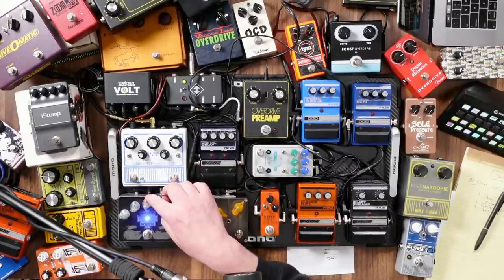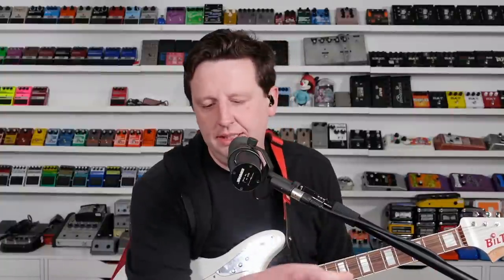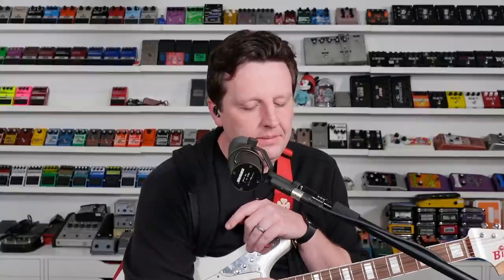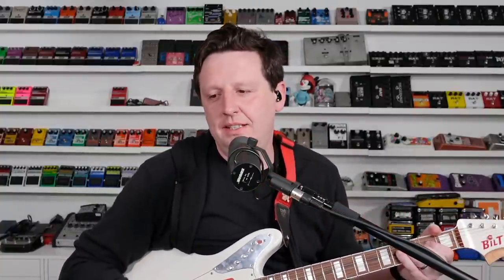Did you say active tone stack? Yeah. Is that a phrase you use? What does that mean? Active means, when most people put a tone control on a 250, they take a potentiometer, one resistor, and one capacitor, and that potentiometer rolls a resistor and a cap to create a high pass or a low pass, however you wire it. They're literally just rolling off the high end. And that ends up making the pedal nasty quiet, causes issues. With this, it's active, meaning there's no loss. It's an actual circuit. There's an amplifier, a chip probably, an op amp, powering that. So there's no loss. Gotcha. You could think of the passive thing as very caveman.